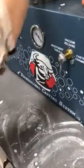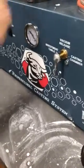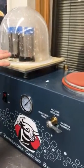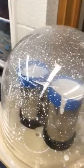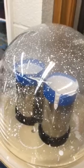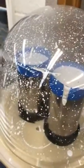I'm just going to go ahead and switch it to the investment table and vacuum. You'll do the same thing — you'll watch the process of the investment rising, it'll be bubbling and splattering, and then it'll sink. Then 45 seconds after that you'll stop, and your piece will be done.